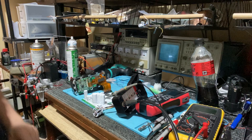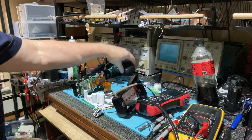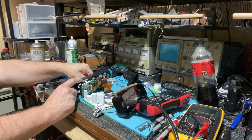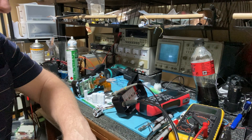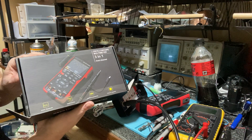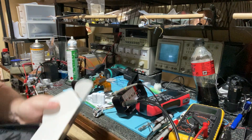It's fairly noisy just sitting there, just at factory default — they're all noisy, these things. It's a bit better after a reset. If you're going to poke around inside detectors and you haven't got a proper oscilloscope, you might be able to muck around with one of these. You could probably just make a coupling loop and use it — look at your transmit waveform near the coil, use it to see if the coil is working.